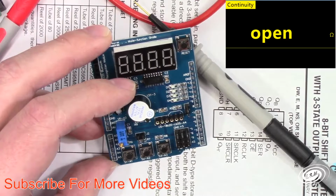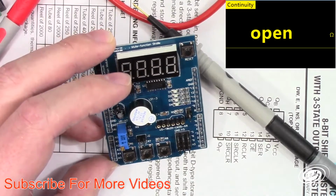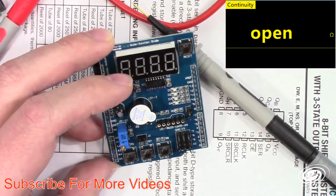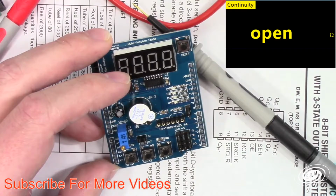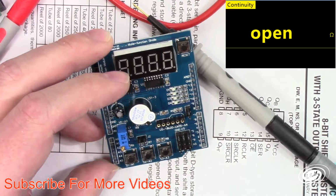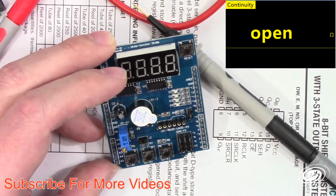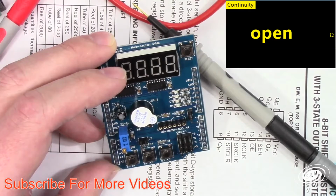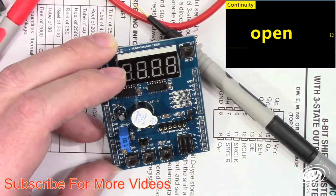And pin 7, did we have anything for pin 7? Nothing for pin 7. Pin 8. Okay, pin 4 was our clock. Pin 7 was our SR clock. And pin 8 was our serial in. And then pin 9 was breakout, and then 10 was D4, this one was D3, D2, and D1.